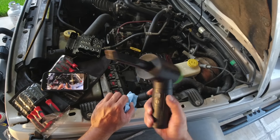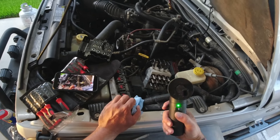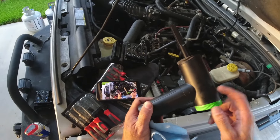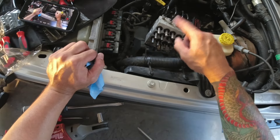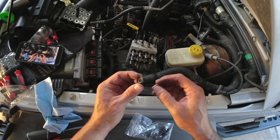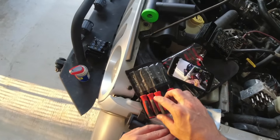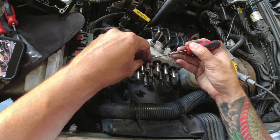It's like having compressed air in my pocket — not as strong as compressed air but it definitely works. It's got three speeds and it works really well. I'll leave a link in the description box. It doubles as a vacuum too, but it works great just to blow small things off — as you can tell I got all the loose dirt right off real quick. I'm going to replace all these seals. There's no wrong way of installing them — they're the same front and back, and the new ones are lubed up a little bit, so I'm just going to grab a pick tool and start picking all these guys off.